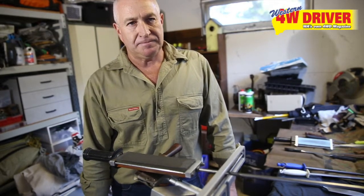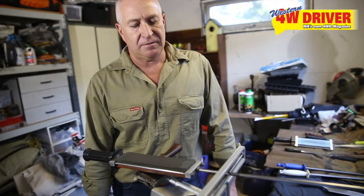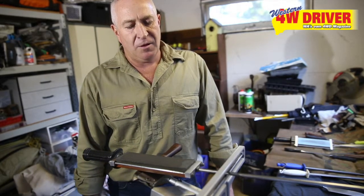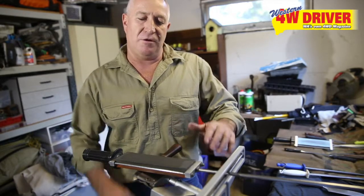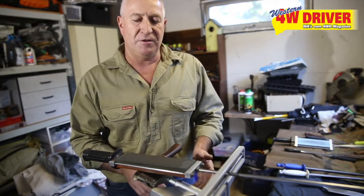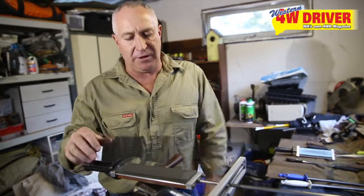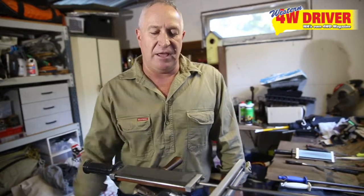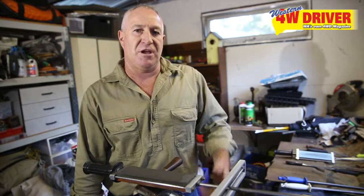So you don't really need stones as such, like loose stones or files or anything like that, because all you need is this and what else? Well, I guess the key to this one here, you're still using a stone, but if you're trying to use a stone manually, not a lot of us are good enough to keep that consistent edge that we're getting by doing it the way we're doing it here. So a system is the best way to reset an actual edge, and then a steel will keep it touched up to keep it sharp as you're going.